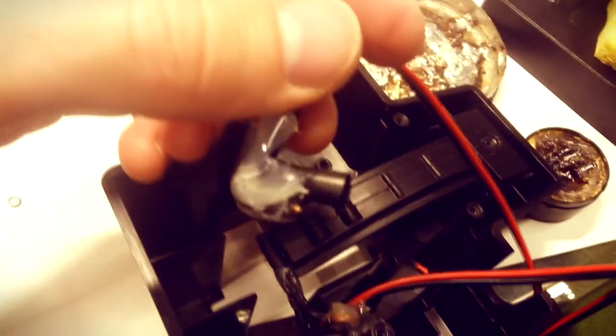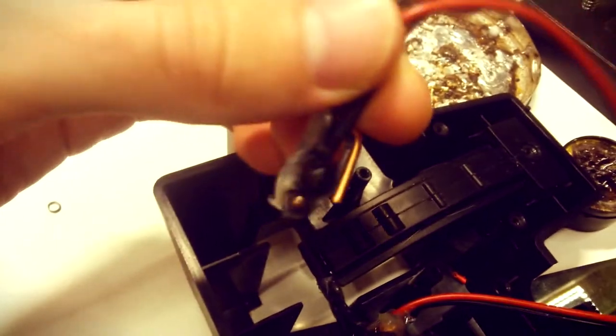So friends, here's the continuation of our story. It took a long time to install all these elements inside the pedal, the photoresistor and light emitting diode. You see I'm putting them into these tubes, and one tube has the photoresistor and the other tube has a light emitting diode. They will be in front of each other, and a plate will be between them. I decided to glue everything with thermal glue, so we'll find out whether it is a good idea.